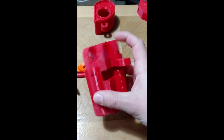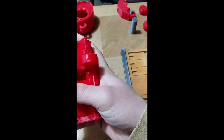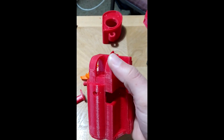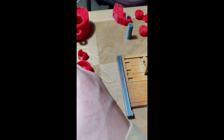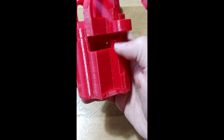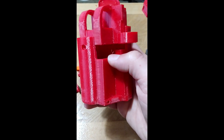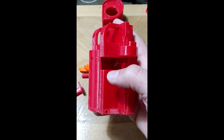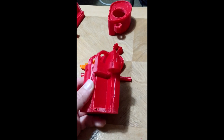I'm not going to put servos in these. Make sure that when you try to push things together you don't push on these otherwise you'll snap them really easily. There is a nice opening that this leaves. Make sure that once you hit this edge right here you don't try to push it any further — I broke the first one that way. It only goes in a little ways and then the servo horn will stick out of here, so don't try to push it in further than it's supposed to.